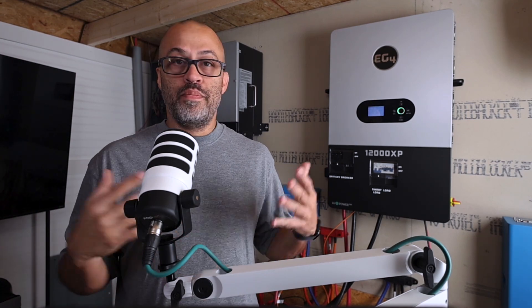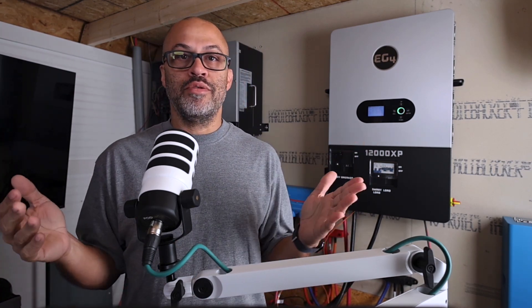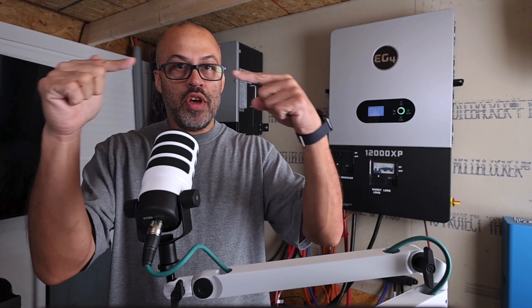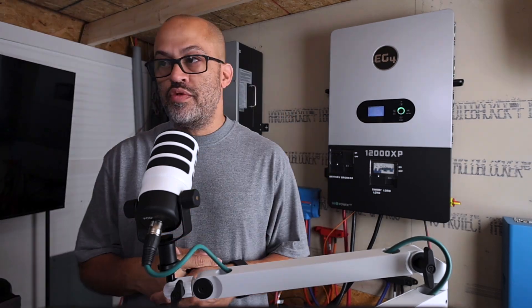For anybody that saw the last video, we're going to basically do a leg imbalance test. I kind of messed it up on the last video — I still had some stuff plugged into the other leg, and that must have been why it was looking like it was balancing. So that was my fault. I have two 20-amp breakers basically right next to each other on the same leg of the panel — a heater and a couple of electric heat guns. We're going to go ahead and turn those on.